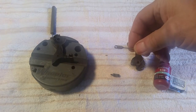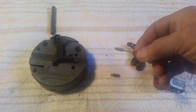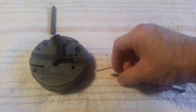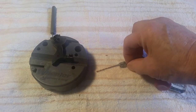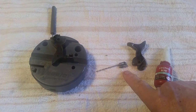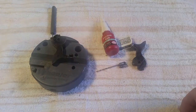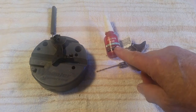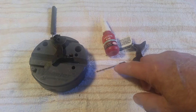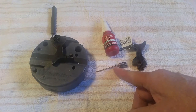I'll show some pictures of the process of what I've done. Basically, I drill a hole in the end of the pin with a drill bit the same size as the point of the original firing pin, drilled about a quarter of an inch deep. Then I cleaned it up with acetone and used Loctite 638 to hold the drill bit shank into place. I'll cut this off longer and polish it to the length, then reinstall it in the gun.